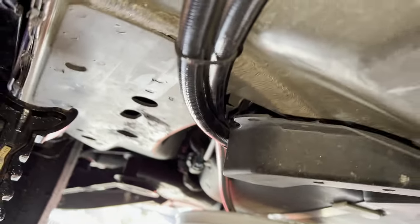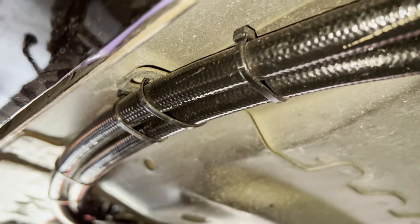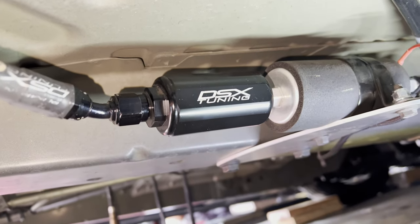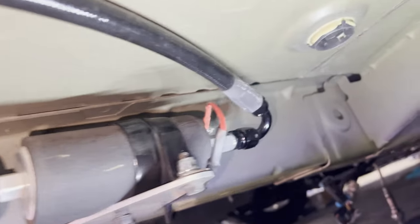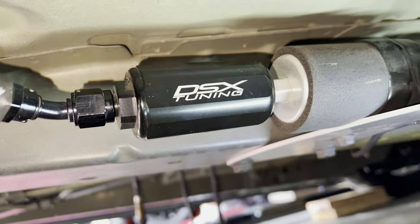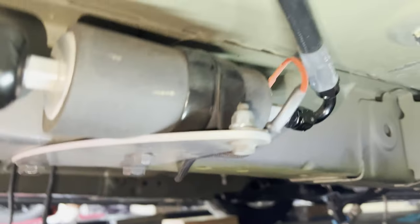Okay, so I'm down here at the bottom of the car getting the E85 drained out. Here are the lines — there's the one line that's actually tapped into the tank, comes down here, and you can see I've got zip ties right here. The inner line comes all the way to the pump — that's the line pulling fuel from the tank and going into the pump. I'm going to disconnect the line up here and the line here, leave the filter in, disconnect the power and the ground, and the feed goes up along the sidewall to the supercharger.